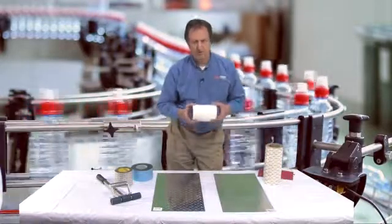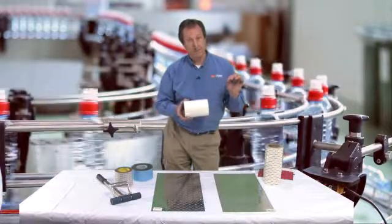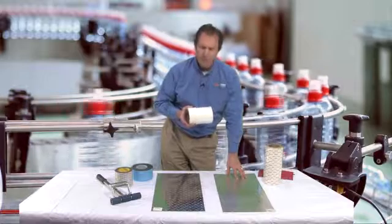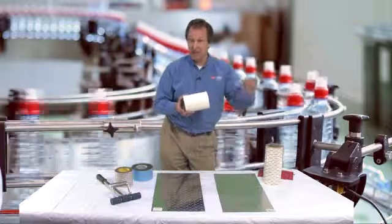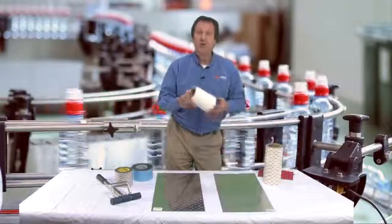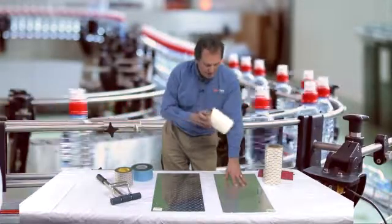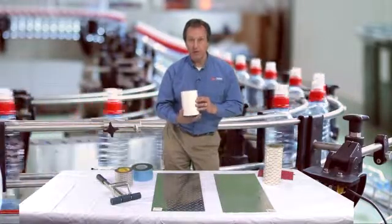Avery makes a product called an 1126. This is a tackified acrylic — it's very soft. It's also what's called a transfer tape, which means there's no carrier in there. If you're going to deal with a textured substrate similar to this, you're not going to want to use either an 8345 or 8346 or anything with a carrier web in it, because it's only going to limit how much adhesive can get into those peaks and valleys. You're going to want to go with a transfer tape — it's solid adhesive, no carrier — so it's going to allow you to press that adhesive down into those nooks and crannies and those highs and lows. This product, being a very, very soft acrylic, will allow you to do that.